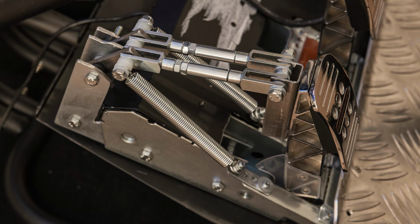I got mine off of eBay and the offer didn't indicate any spring rate, so I had to measure the spring rate myself using some weights that I had lying around. I measured it in at 0.56 Newton per millimeter, which could be off to either side. It's not a very precise measurement.